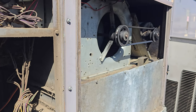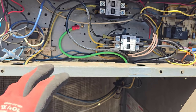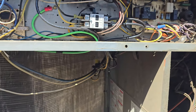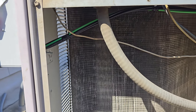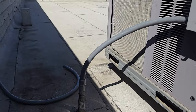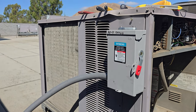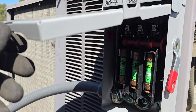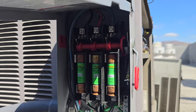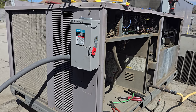We are ready to turn on power. We opened up the indoor blower section so we can see the phase rotation. We eliminated all the wires — I was able to make the ground. I had one of the right connectors to go right to the ground spot. We're going right into the contactors now with the wire; it's secured up so it's not going to rub out on anything. Unfortunately, this is the only disconnect I can get right now. We are having a heck of a time with disconnect switches. This one — they don't make it anymore. This is the old Siemens 60 amp and this is the new one, and they stink. There's not enough room in these things. They're way too tight. I was using GE disconnects, but I can't get GE disconnects right now either for some reason.